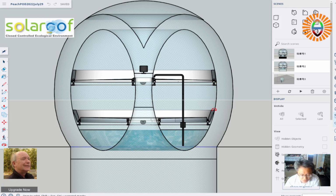We still need the gutter because the gravity of the water from above is really powerful. If it just hits the sand surface, it will create a hole, and since it's moving, it creates a ditch. So for that reason, we need another big gutter around. The gutter simply protects the sand from the water impact. Once the water enters the gutter, it overflows from the outside. Similar to the small ring gutter, this is a big gutter ring. Anyway, that's something we need to consider.